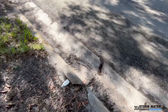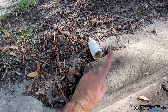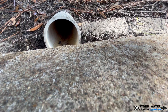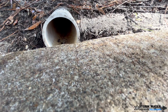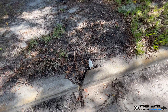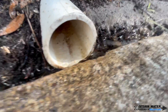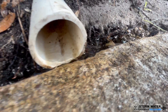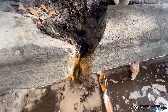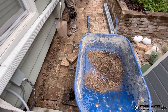This is what I was talking about earlier — a one-and-a-half inch line that they ran underneath the sidewalk to drain the system. This is just insane. You do not ever want to reduce when you're draining any kind of system. If you're going from a four-inch line, it needs to either discharge with a four-inch line or you need to up it to a six-inch line or bigger to discharge it. Never go down in size when discharging a drainage system.